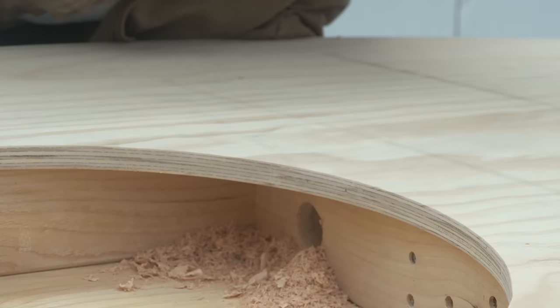I'm flipping the table over so I can put some three-eighth inch dowels in those screw holes we made earlier. I added wood glue and knocked them in with a hammer. Once the glue dried, I came back with a flush trim saw and trimmed them flush. After that, I sanded the whole frame and the bottom of the table first with 150-grit sandpaper, then 220. I repeated those same steps on the top of the table as well as the center cutout for the turntable, and used a flush trim saw to trim the dowel on top there too.